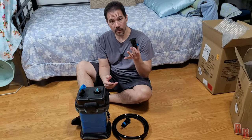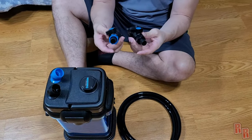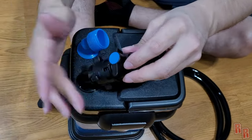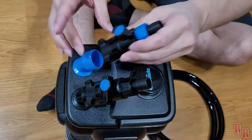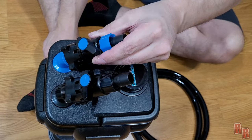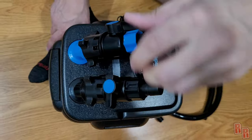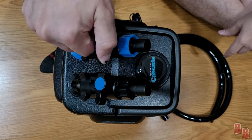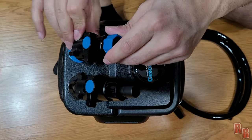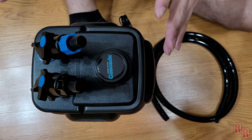Here's a brief demonstration of how to connect the hose. One fitting is blue, one is black — you put the black one onto the black port, spin it down, and tighten it all the way. For the blue one it's the same thing. The cool part is that even after you tighten them, you can still rotate these fittings around — so you can position the shutoff valves however you want. Just tighten fully but don't over-tighten.